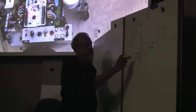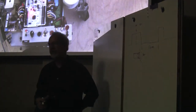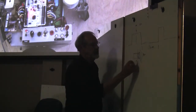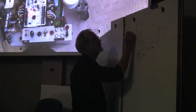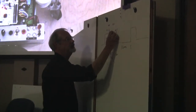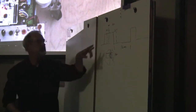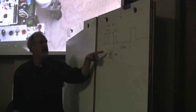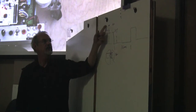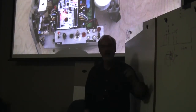There is one other optional change to this, which is that most servos can go more than 90 degrees. A lot of modern servos, cheap off-the-shelf ones, can go 180 degrees. In order to go 180 degrees, essentially what you have to do is give it a larger signal, one that goes from 0.5 milliseconds to 2.5 milliseconds. If you have a servo that can handle it, you can send it this wider range, and your servo will rotate all the way through 180 degrees. That's actually pretty common. Our motor controller doesn't want to see anything lower than 1 millisecond or higher than 2 milliseconds. There's no real servo arm in here, but we'll have to limit the range to that. Any questions about that?